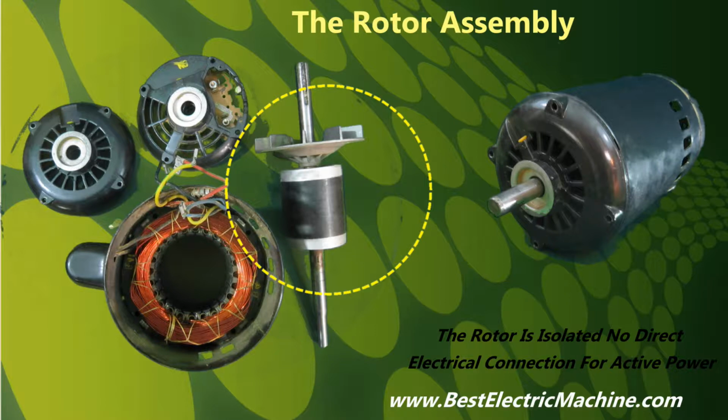Instead, the rotor squirrel cage winding power of the standard induction electric motor is a mutually inductive coupled component of the stator active winding power by a speed-based asynchronous movement or slip phenomenon, called slip induction. In effect, the rotor only passively participates in the electromechanical power conversion process by simply completing the magnetic circuit path across the air gap to establish the mutual air gap flux density.